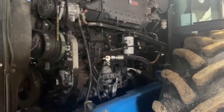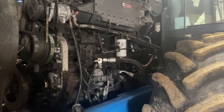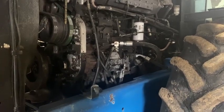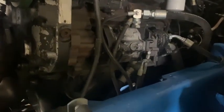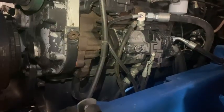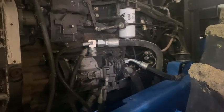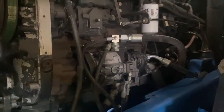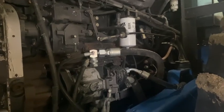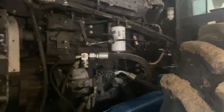Anyway, they're similar to an N14 Select Plus, but they're not the same. This guy just wants an oil pump done and bottom end bearings. I see it actually has had an oil pump done before. You can tell that the color is different. I don't know if it's under his ownership or what, but from what I can tell, the cam box is done and an oil pump. So given that, I might talk to him and see if he still wants to do the pump. But I'm sure he will. This guy takes pretty good care of his stuff.